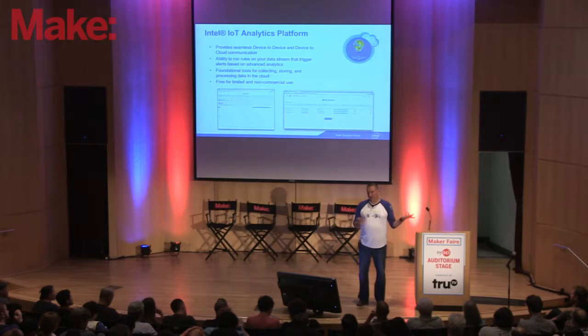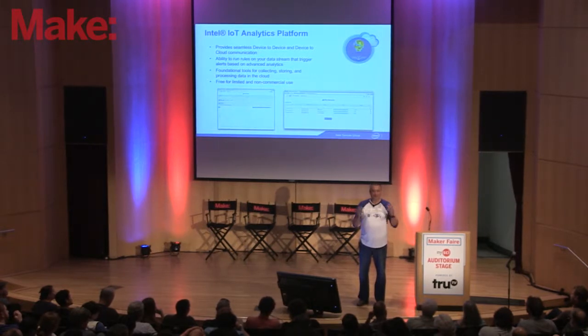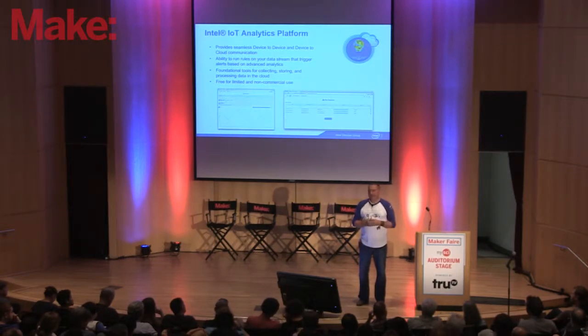We have HID up and running right now. A lot of you have come back and said, hey, we really want the PS3 controller to talk to this thing. So we're jamming PS3 control capability into that as well. And then all of the appropriate things, like all the GATT protocols for BLE, we're going to integrate in the second software release. It actually is in there right now. We use the BlueZ 5 stack. We just haven't validated all of the profiles. Other question? Yes?